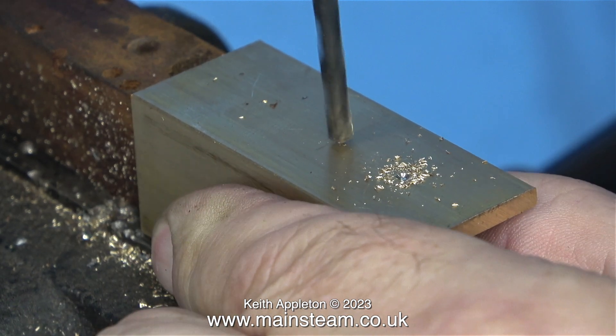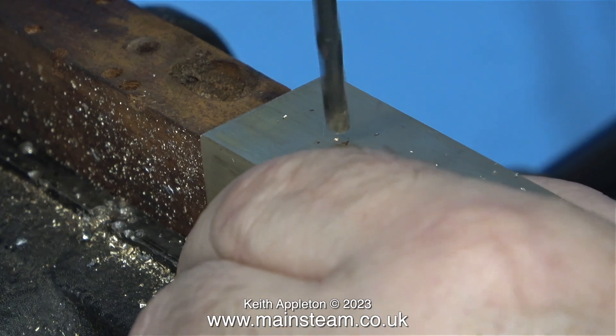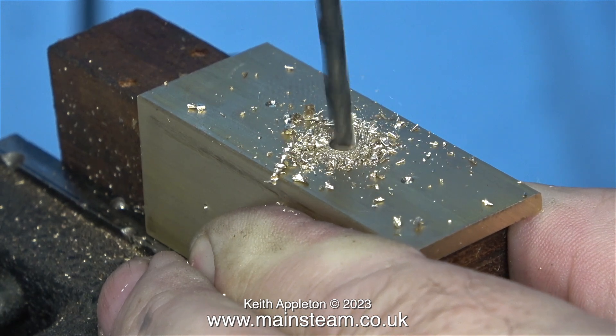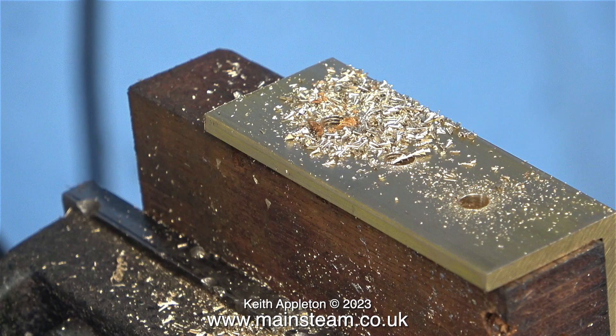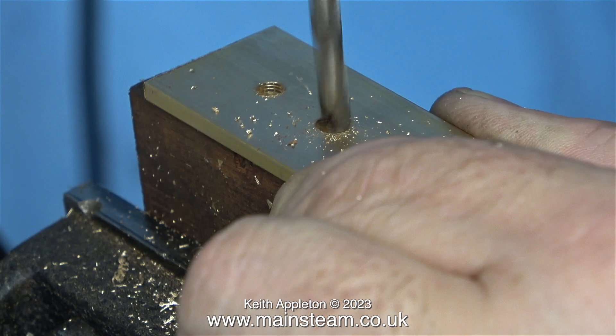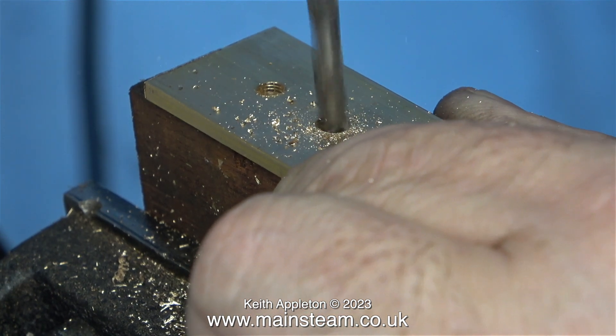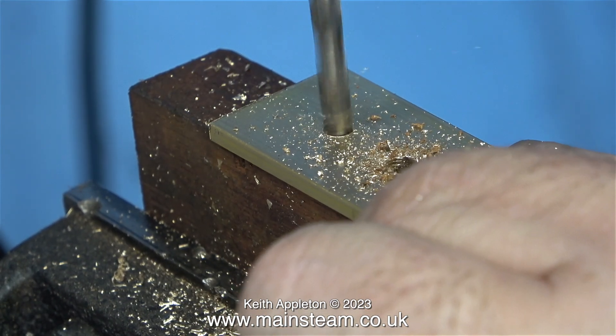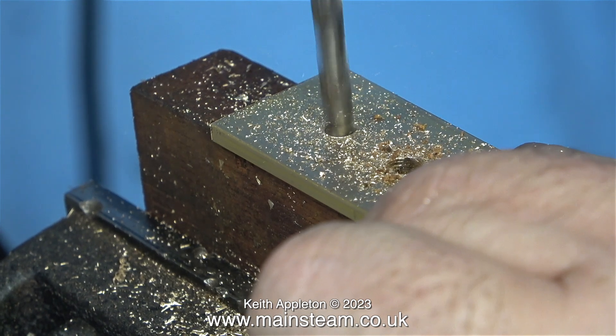Now it's over to the drilling machine and I'm actually drilling the holes smaller than I need them to be. In this episode, for initially drilling the holes, I am not using a centre drill — I'm using a smaller drill size than I actually need. Why is this? Well, if I drill the hole slightly in the wrong place I can correct the error using a needle file, and then once all of the holes are in the right place I can drill them using the correct size drill, which is 3/16th of an inch diameter — clearance size for 2BA. On larger drilling jobs I do not hold the pieces of metal in my hand, but this is fairly safe as it's up against the mahogany block so it would be very difficult for it to spin around and cause any injury.